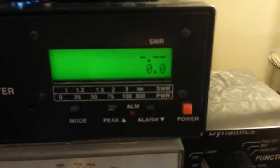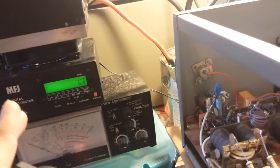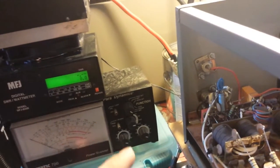Okay, let's go ahead and turn the box on, all the way down. Floating about 18.9. Another good thing about this, if I was using regular square bridges, this float voltage would be a lot lower. That's another cool thing about this rectifying module. You have a lot lower voltage drop, like you would normally with the square going across the two rectifiers. So you got that 0.7 volts, a lot lower voltage drop, so you get a lot of your volts back.